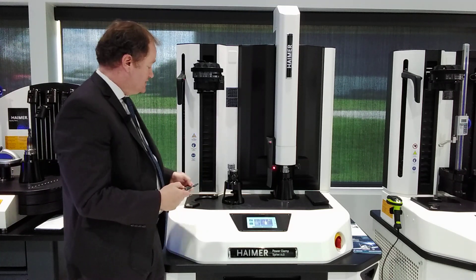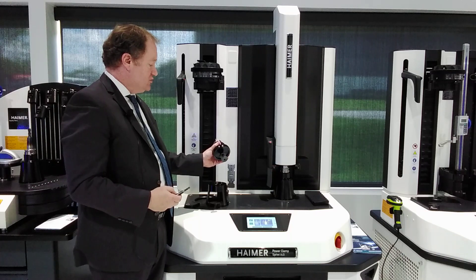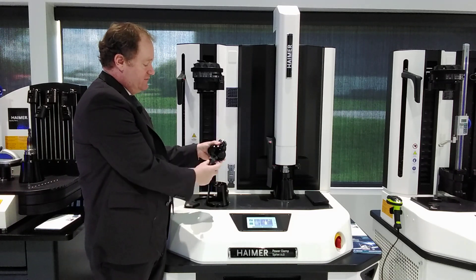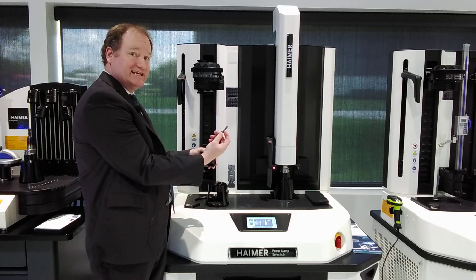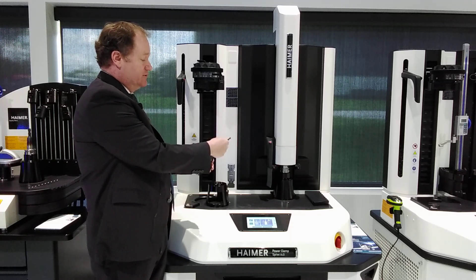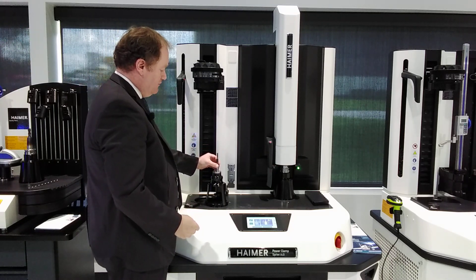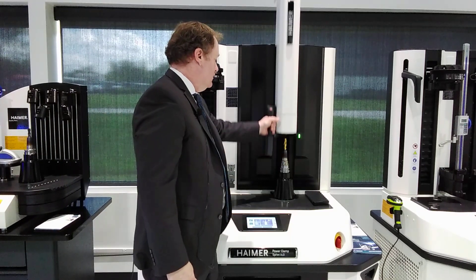While that one's cooling, we'll go ahead and start setting up for our shrink fit ER collet. This fixture holds the ER collet — we have multiple different sizes for the different ER series. There's a little height gauge here that's integral and you can adjust this screw. If I'm taking out this end mill and want to put the exact same sort of end mill in, it's going to have the same gauge line. I can shrink out the tool, put the new end mill in, and it drops right down to that stop. There are some little grooves on the bottom of the collet — we bring that in line with this fixture and bring it over.